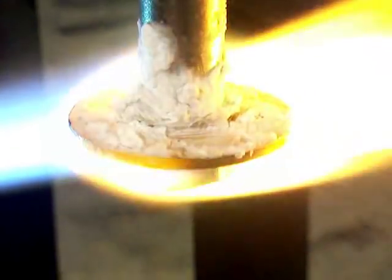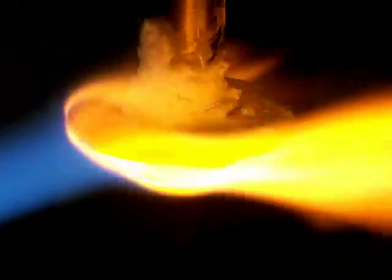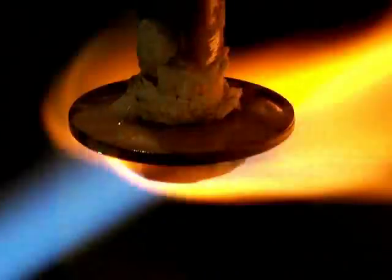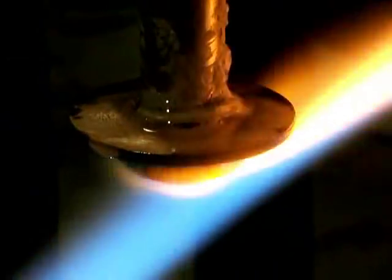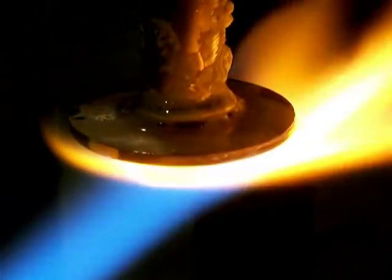You can watch the flux start to react and boil, getting close to reacting temperature. The copper is starting to get hot, and the bottom of that bolt head is starting to get hot. I threw a little bit of heat up top too to make sure everything is even. Now you can see the bent ring of silver braze material.